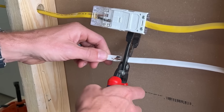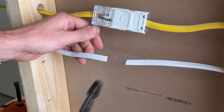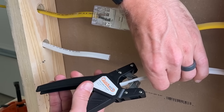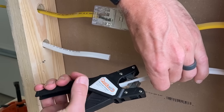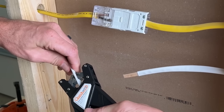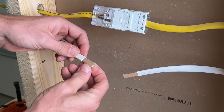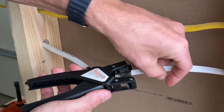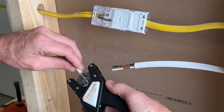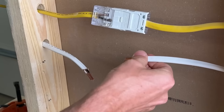The installation could not be easier. You can actually cut out a section of the wire, which can be a lifesaver if you don't have any slack. Then you use the Quick Wire wire strippers to take off the jacket — stripping off 22 millimeters, or almost one inch, of the outside jacket. In the US we have a paper cover to remove; in the UK they do not. With the paper removed, line the edge of the jaws up with the jacket and that takes off the exact amount of insulation from the hot and neutral. Pull off the insulation and you're ready to go.